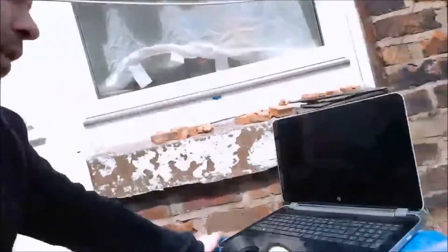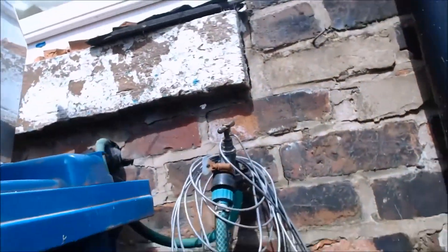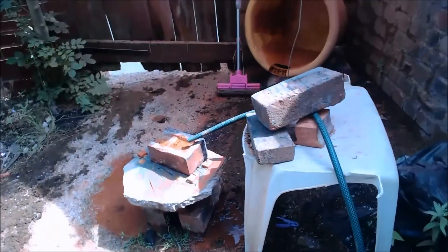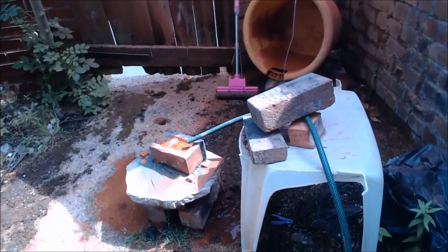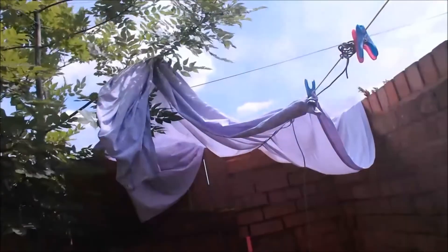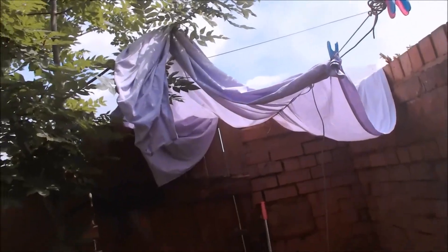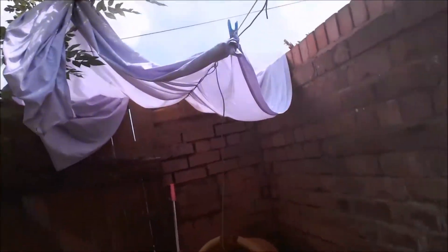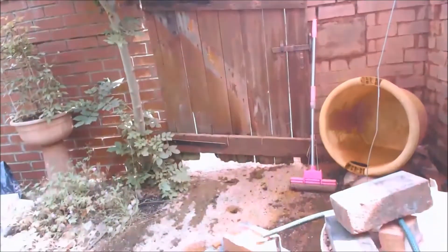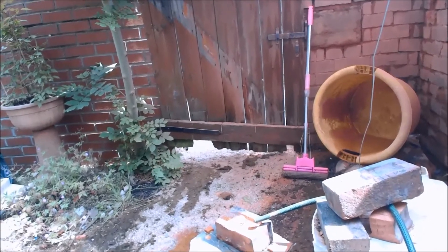There's a hose pipe here and I'm running the hose along here, down over my brick there. I'm using the hose to wet the walls, and then I'm using this cover here to capture any extra dust that might come off the cutting. Between the three — the cover, the walls, and the brick with the hose over — I'm reducing most of the dust that's coming off the process itself.